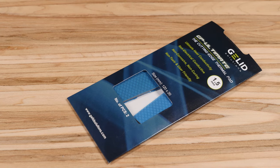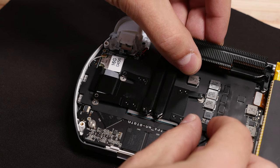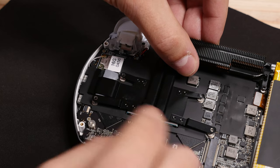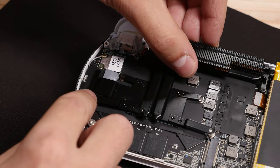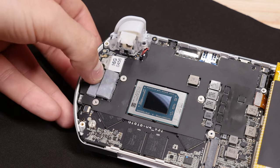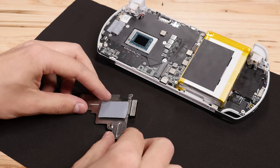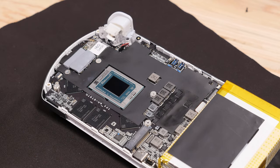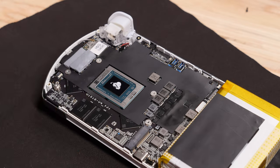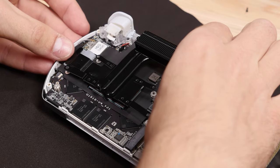The thermal pads I'm using are the Gelid Ultimate 1.5 millimeter thick. I'm testing the cooler to see if it still fits properly with the added thermal pads as it did seem a bit thick — so maybe the 1 millimeter thermal pads from Gelid may work even better, but the 1.5 mm are the ones I could get at the time. The 1.5 mm works just fine after testing. I then replaced the thermal pad under the first part of the heatsink and applied new Thermal Grizzly Cryonaut thermal paste. I see people recommending the Noctua NT-H2 but I can confirm the Thermal Grizzly also does a great job.